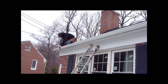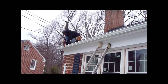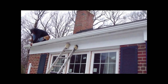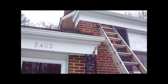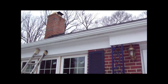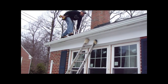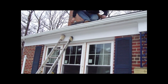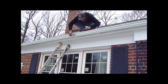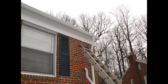Now folks, we don't use the old-fashioned spike and ferrules anymore. These are actually snow clips that go up there that are screwed directly into the roof trusses. Now we go through and pre-mark that to make sure we're screwing into the truss, so you've got a solid foundation there for that screw to hold. So he's going to go down to the other end now, level it, and then go back. And depending on where the trusses are, he'll put it on 16 or 12-inch centers, whatever's required.